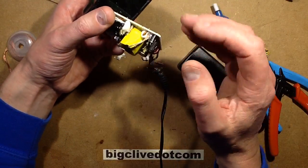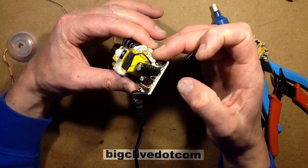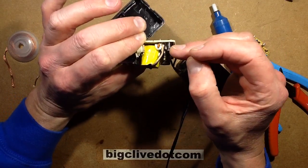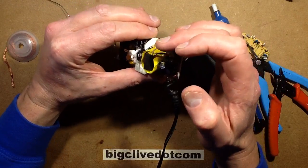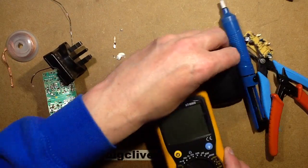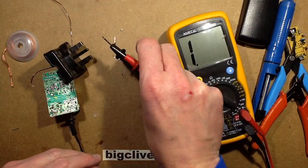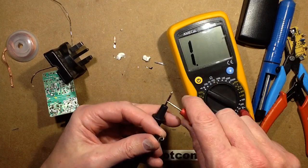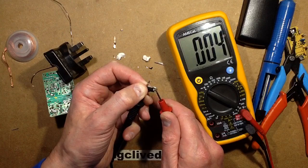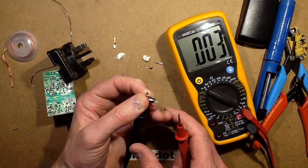I routinely checked what components I could see. Sometimes the output diode goes short circuit — the diodes in these often fail because they're under quite a lot of stress due to the high frequency output of the transformer. I measured it, and indeed it had gone short circuit. Here's the original diode — the meter's in continuity mode — and if I stick it across this diode, it's showing just a dead short circuit either direction. Common enough failure mode for the diodes.